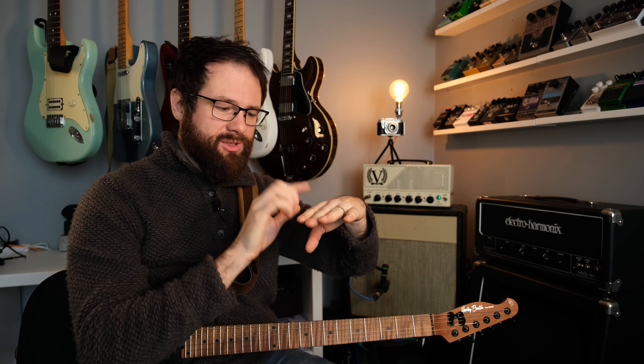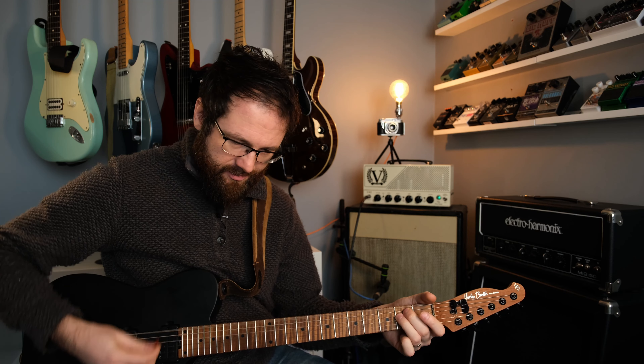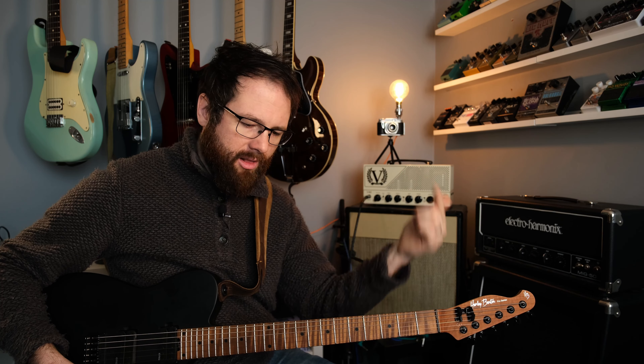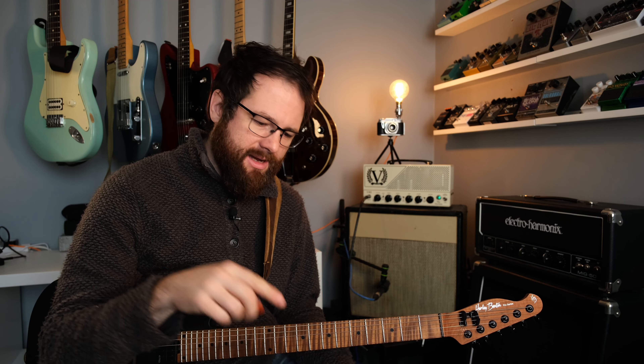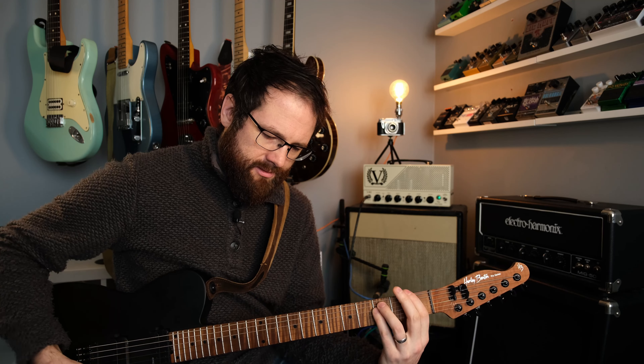I'm going to turn clip one off for now to bring clip two in. The interesting thing is the noise didn't drop — we've got a drop in volume, but the noise didn't drop. That sort of tells you where your baseline signal really is: the noise is sitting there, normally your signal is going right up, and now the diode's clipping it. So that's compression — the difference between the noise floor and the peak we're going to get from the signal. We do get a lot more saturation, and the high end comes in a lot nicer on this one. This also sounds a little more mid-scooped by way of the high end coming up. The characteristics of these clipping diodes are that it shears off low end. Definitely gets squishy like they're described on the website.